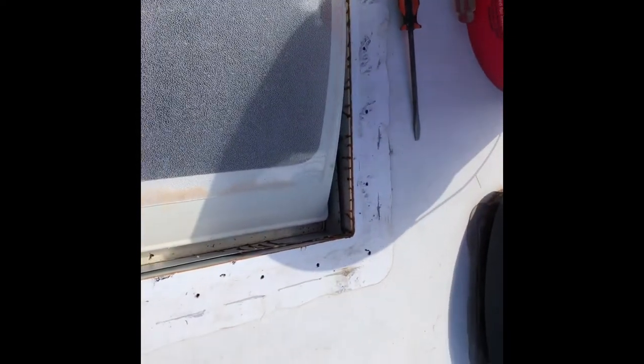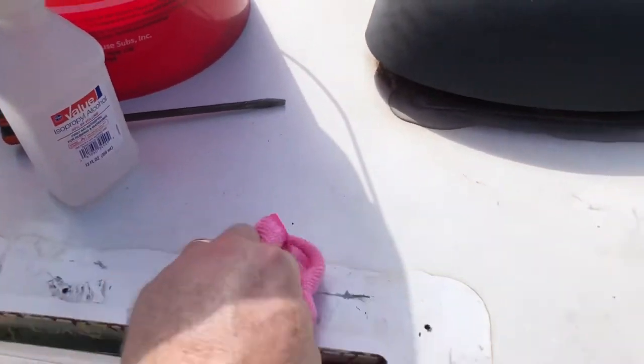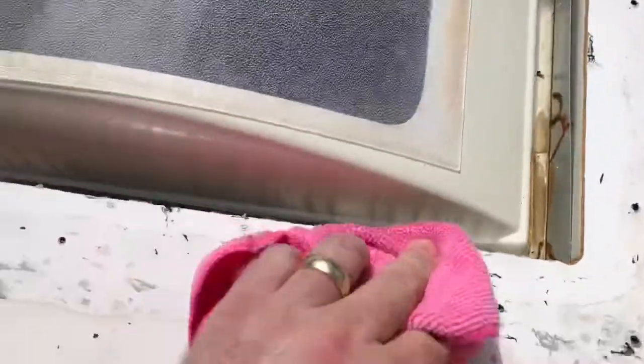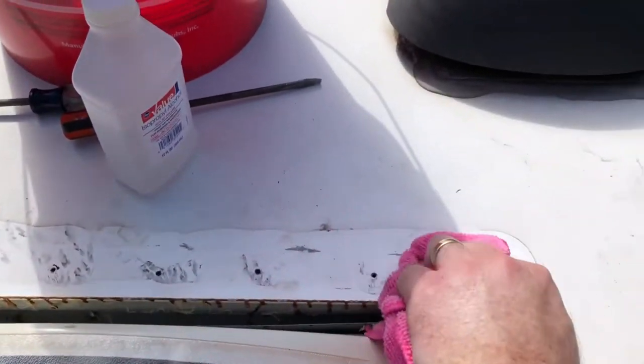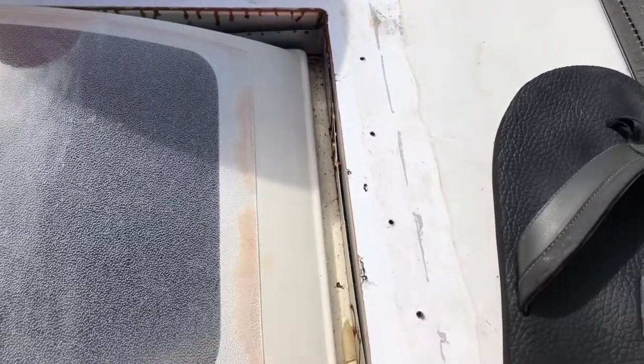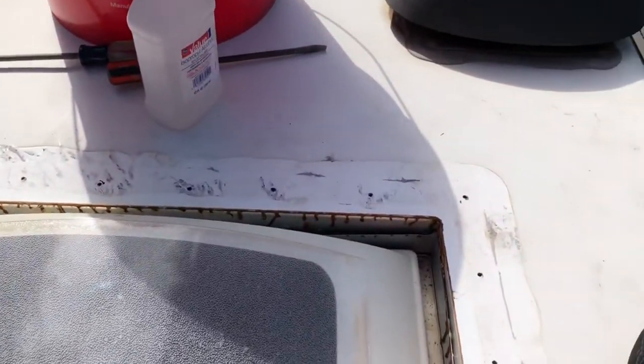Just pressure and time — it'll come up. You can see now that I've got the previous lap sealant removed. It is tedious, just take your time, go slow. I used a screwdriver in my hands and just kind of peeled it up. I'm gonna clean it next with some rubbing alcohol and a towel, get it good and clean. We're just cleaning the area with plain old rubbing alcohol and a rag. It's gonna be clean enough because again we're gonna reseal everything with a generous helping of lap sealant. The question will be whether the holes line up with the new one — and that's okay, because you can just use the holes on the skylight and drill new holes with self-tapping screws. Just seal the old holes and that's it.